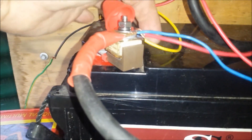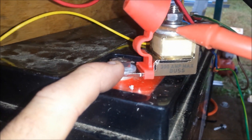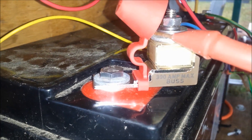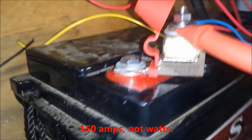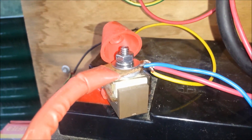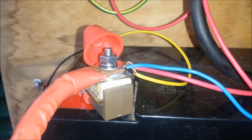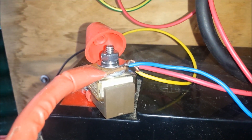Now all this extra wiring — I've still got the lights and the voltmeter hooked up, and I've still got the pump hooked up. Over here I've now got a fuse. This is a Blue Sea marine grade fuse holder, rated at 58 volts, 300 amps. I've got a 150 amp fuse on there. At its peak, the fridge will draw 750 watts, so I just want to make sure I've got enough there — and that's really just in case things short out.